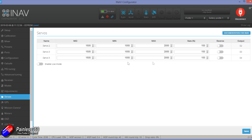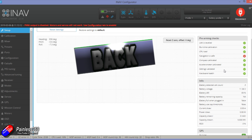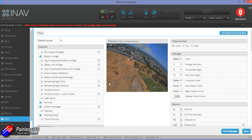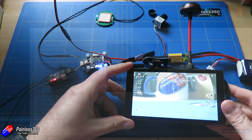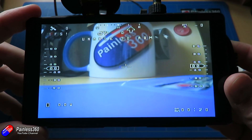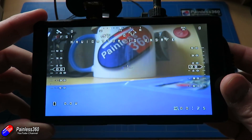Servos haven't been changed. Scrolling down — not too far as it has location information — we have a 3D fix with seven, now eight satellites, which is not bad considering I'm indoors. The on-screen display is configured the same way as a standard iNav configuration on a regular flight controller, but the way it appears in the OSD is very different. I'd always recommend having your goggles or a little screen powered up while doing this, because the whole point of the Radix is that its on-screen display is very different and much more sophisticated.